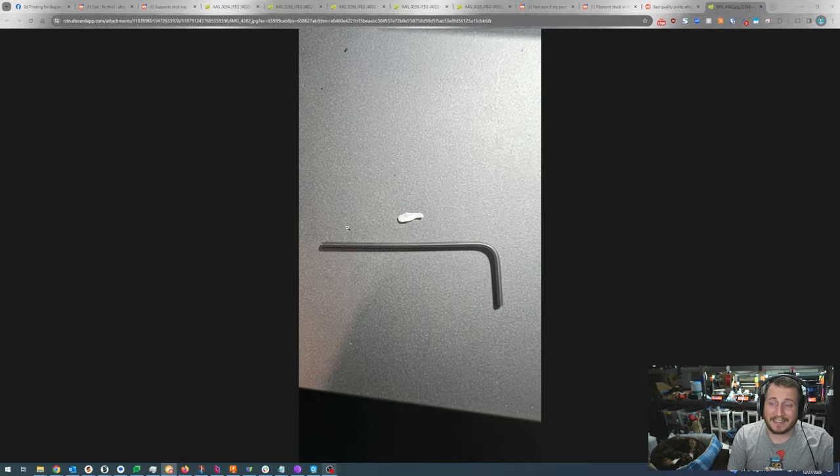If you can drop the nozzle and check it — if you have a brand new nozzle in there, we know it's not the nozzle, which means there is probably something else stuck. This can happen if you don't pull out your filament when doing a filament change. If you leave it sitting in the cold side on the MK3S, it will basically create a little blob that gets stuck in that PTFE tube or in the cold end. Even though she changed the PTFE tube, it was stuck between the PTFE tube and the actual heat block — about a seven millimeter long fleck of filament appears to have been the entire nightmare.